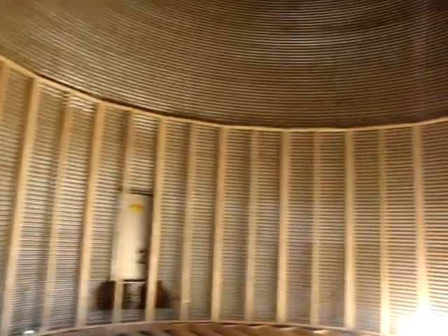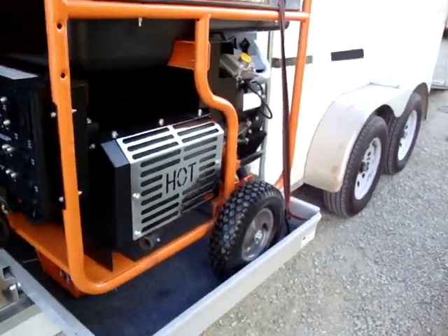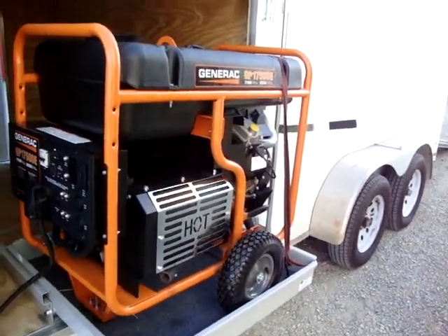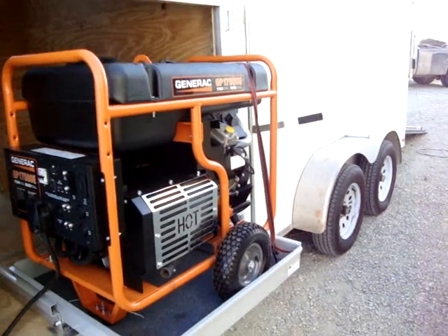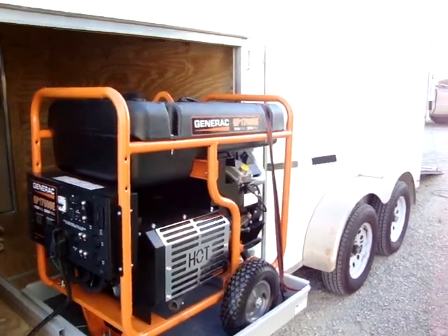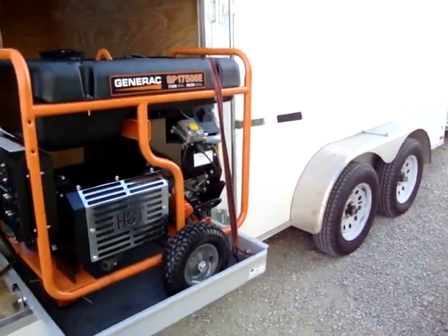Here's the inside of the silos we're going to be spraying today — they've framed up the floor and all the walls. We have a 17.5 Generac generator on an RV slide that allows the exhaust to come outside the trailer, putting a good bit of heat outside as well. We have the only hydraulic unit in the industry that the entire system can run off a portable Generac generator. Just about every other machine requires a large diesel three- or four-cylinder generator, which adds ten to twelve thousand dollars to the normal cost of a trailer, plus you need to upsize the trailer and the GVW of the axles. This is a great mid-entry-level machine — you're going to get professional results without breaking the bank.